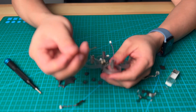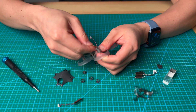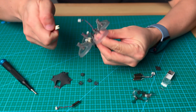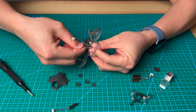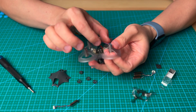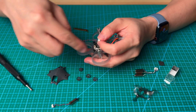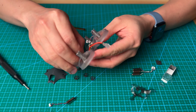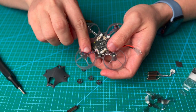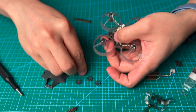Push it all the way down. You can use the prop tool again to push the bottom — use your finger to hold the motor part and push the motor all the way down. After you install the motor, prop it in. Align the wire — this space is designed to keep the motor wire inside. Put it in.